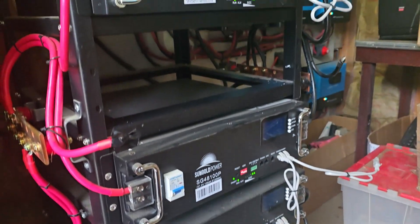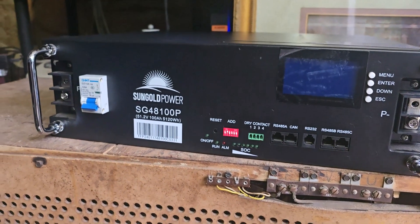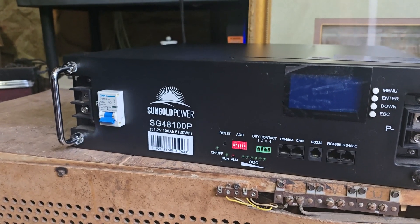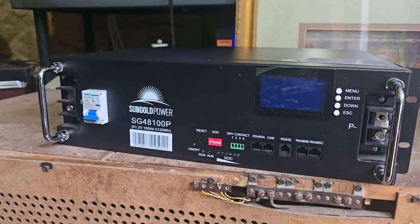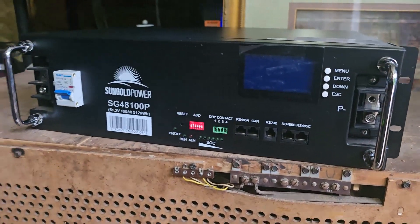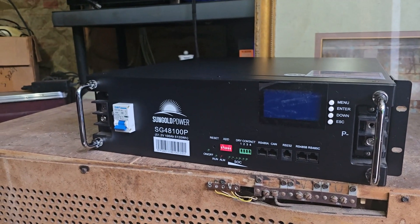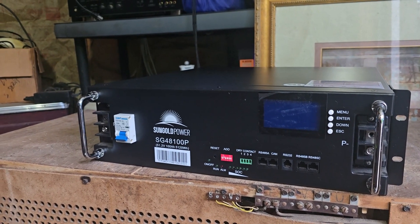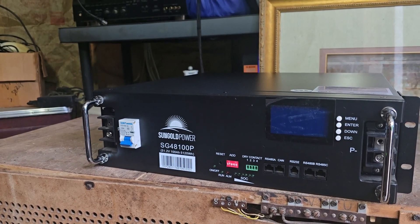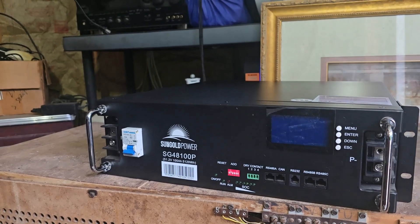Good morning guys. As you can see I'm missing a battery - this battery that's out of the bay is over here. I've had an issue with it going into alarm, and tech support, instead of having me ship it back - it's a hundred pound battery - is having me check it myself. There's no power in it, it's completely dead and totally drained. They want me to look at the battery temperature wires because it's saying the batteries are at minus 40 Celsius. They think something might be wrong with the wiring harness of the battery temperature sensors.